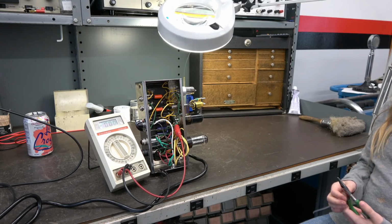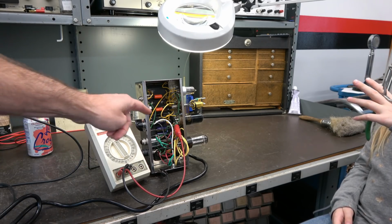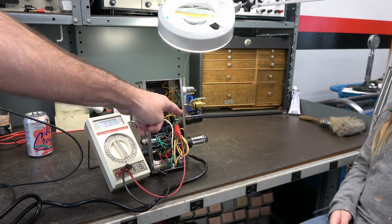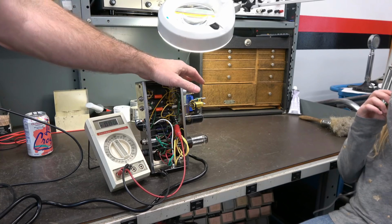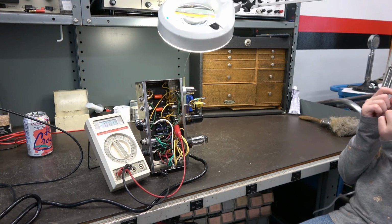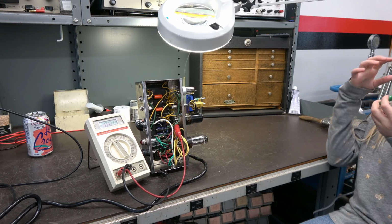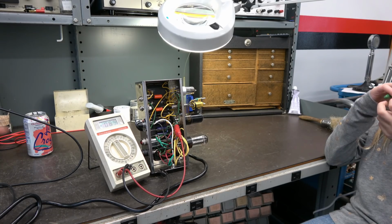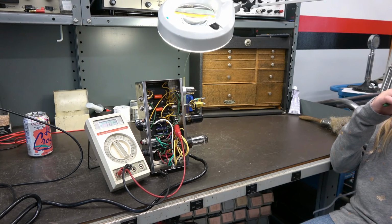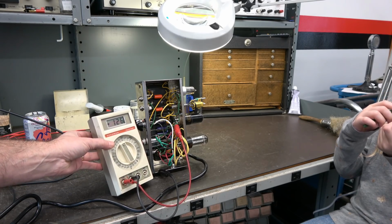All right, Em, so what I'm going to do, we know that the amp appears to be wired right. I've got a meter now set up, and we're going to look at the high voltage going right into the output tube, which is the 6V6. This little crazy thing is just a resistor, and it's going to simulate a speaker. So I'm going to bring up my Variac nice and slow over here, and you should start seeing this meter going up if things are good, okay? I'm over here watching my Variac, and I'm watching the current. If I see something go wrong, look at, what do you see? Look on the meter, Emmy. Do you see? It's moving. Yeah, that's 125 volts.